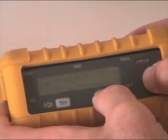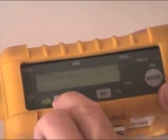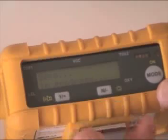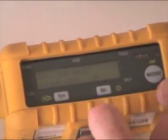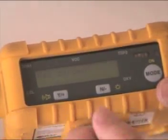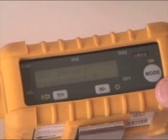It's going to pause the data logging. Calibrate monitor — we're going to say yes. Fresh air calibration — yes. Since everything was zero it might not be a big deal, but we don't know where this might have been zeroed in the past. Bringing in fresh air — we're in an office environment so it should be clear. It goes through this pretty quickly. Zero cal done.